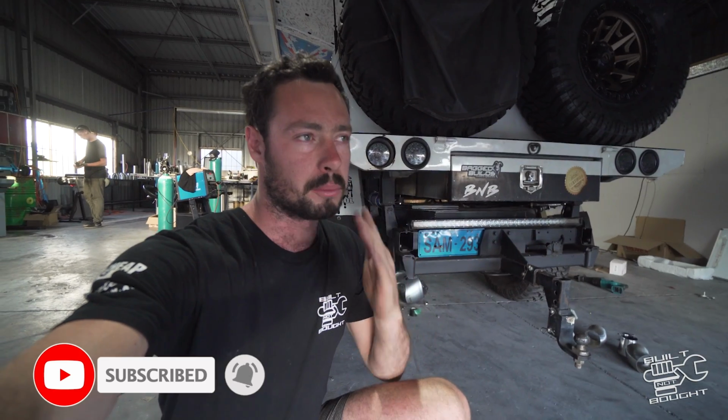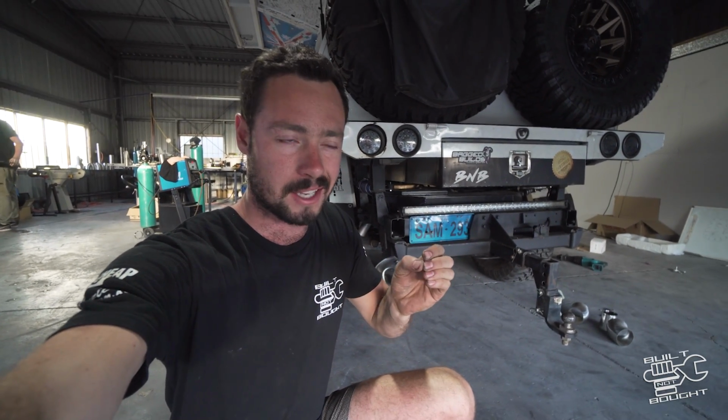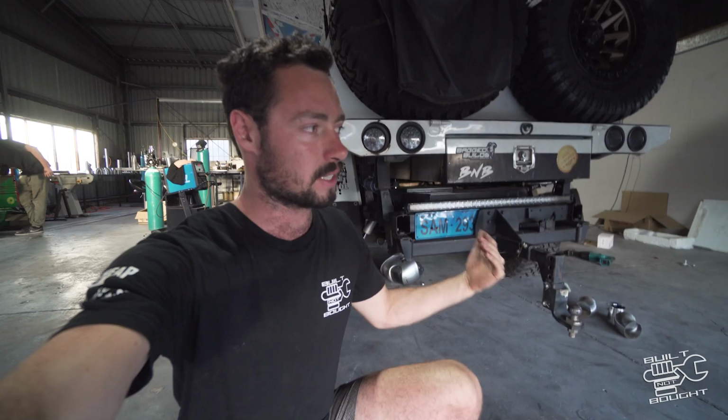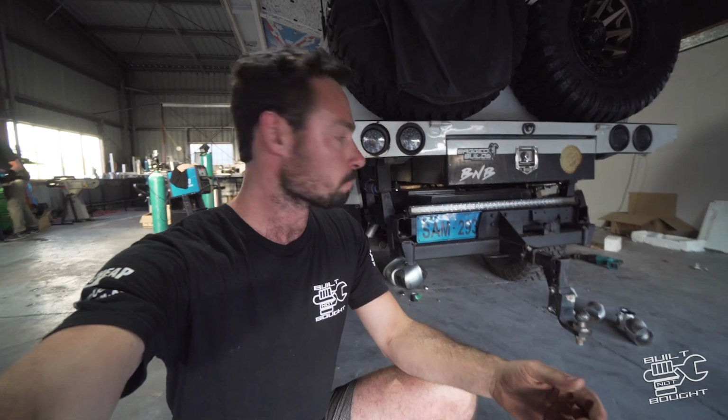After that, he's done a Y piece, which is different to where it was before. Before, there was a straight through section to the back and then another piece that teed off. What he's done is a symmetrical Y piece, bending either way, so it gives even exhaust to either side, whereas before it was weighted to one side. That'll help the flow a lot better.